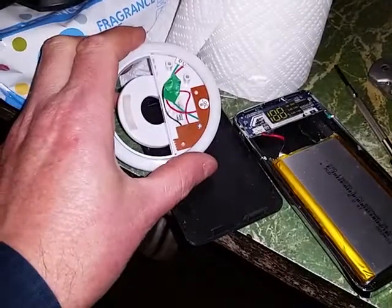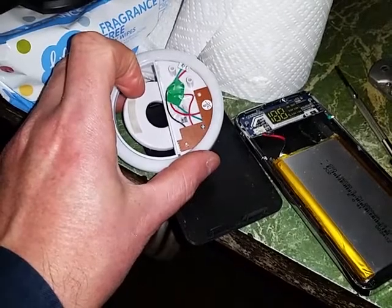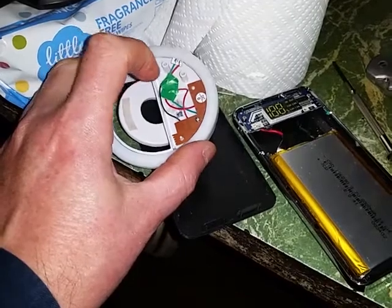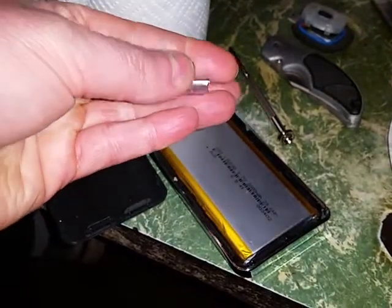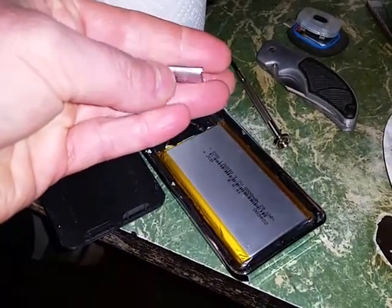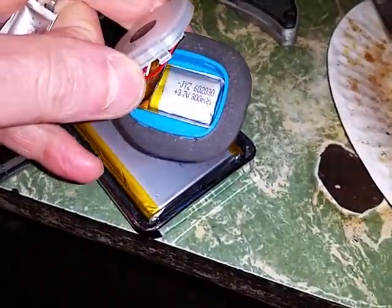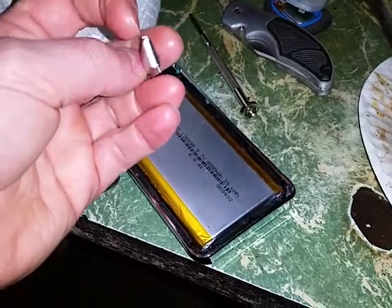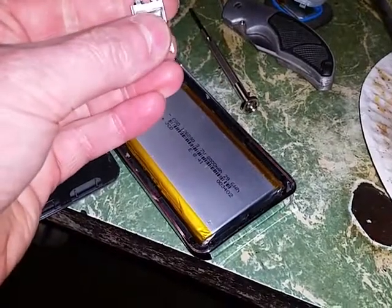Intriguingly, with this one, as I was saying, I charged it twice, trying to get a bit more charge into it. I charged it up an hour after the second charge, and what did it do? The old classic. For those of you who don't know, see her, she's all bloated up. It should be nice and flat like this one. If you keep charging from that point, it'll go bang and pour steam out the end and burst out the little bag. But that's a sign of overcharge.